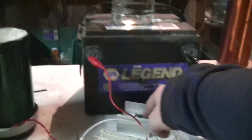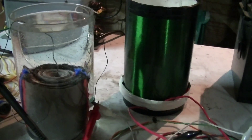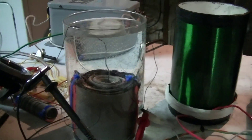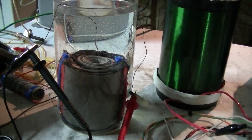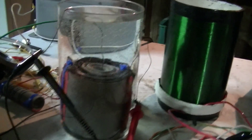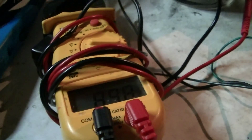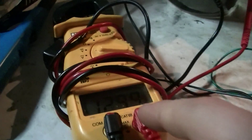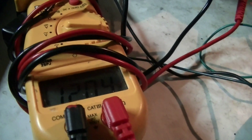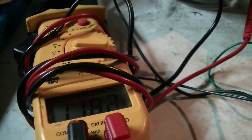I've been playing around with switching circuits and blocking oscillators, trying to get a high-power MOSFET to work properly. I might switch back to a transistor. What I really want is to increase the voltage on the cell without increasing the total current draw or the joules delivered. Now I'm turning it up to full power — 12 to 13 volts on a fully charged battery. To control this experiment a bit more, I'll pull the charger off — that's more accurate.